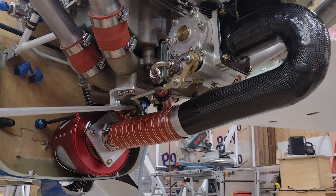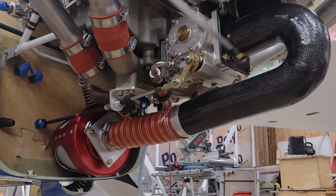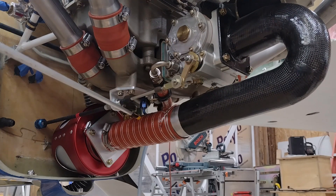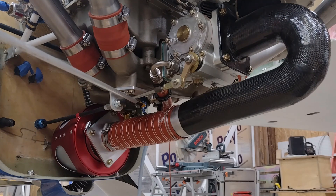That's this blue sniffle valve right here. There's a little ball in there that falls down and allows any fuel or water to drain out this hose. As soon as you start the aircraft, the suction of the induction system takes that little ball, sucks it up, and closes it off. The valve is closed until you stop the aircraft. Especially with us in the parking position, it drains any extra fuel that may accumulate — you don't want any backfires or kickbacks when starting the aircraft.